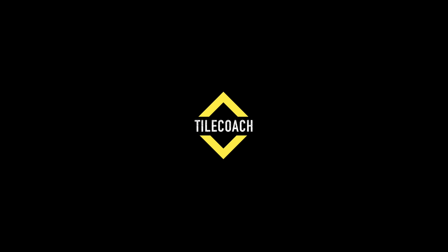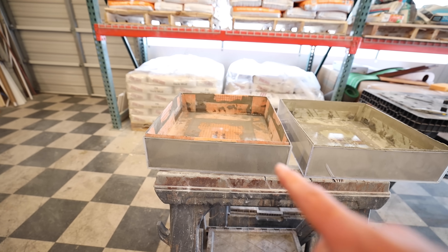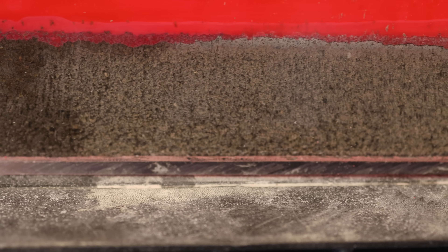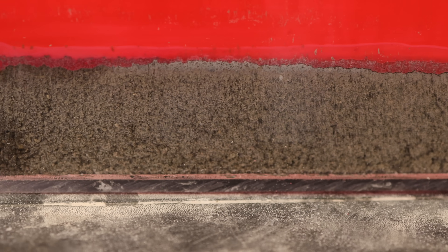See, there's one right there — watch if I push it, they're filled with water. So these little blisters are all over the bottom. You can see that tiny little crack that I didn't get with my third coat. I've been making these acrylic plexiglass boxes to do real-time testing to see how these products work, and I just did a Schluter-KERDI and Laticrete Hydroband glass box test. I'll put the link in the description below. These glass box tests are awesome because I can see what's going on without having to tear it off — I can see it in real time as it happens.